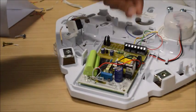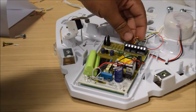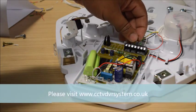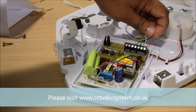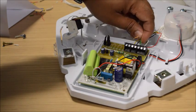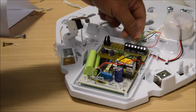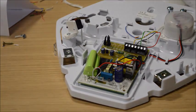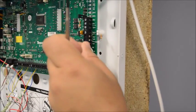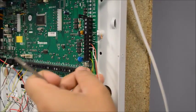So that's how it looks. I've connected all five wires. What I've done is I've put in a resistor, which is 2.2k in this case, between the tamper and the ground, and that makes a circuit for tamper. So I've got the power to start with, a positive, and I've got the bell, then I've got the tamper, then I've got the ground, and I've got the strobe. And I've got a resistor that goes in between the ground and the tamper. To start with the panel side, I've got the positive that goes to the first terminal, then I've got the bell, and I've got the tamper, and I've got the ground and the strobe.